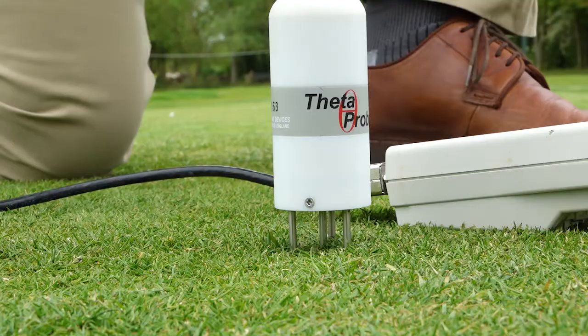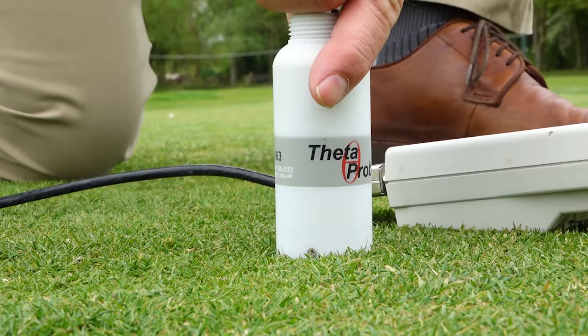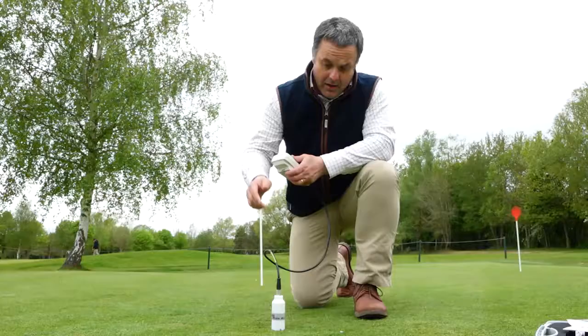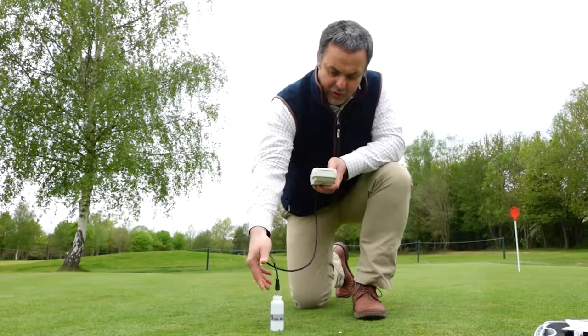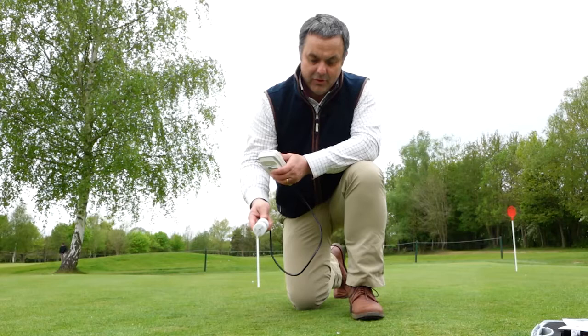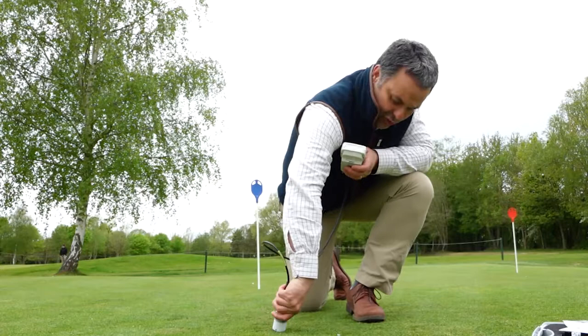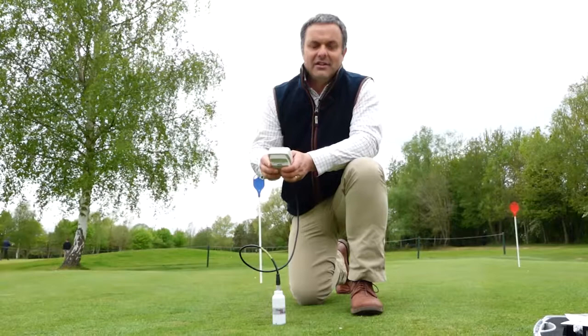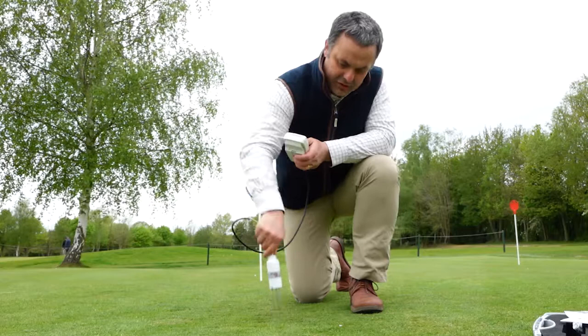So get the protocol right. Push your pins in so that the pins are fully inserted and the sensor is just resting on the soil surface. Don't force it in any more than you need to, but don't leave the pins exposed to air. Another important consideration is when you've taken your reading — by pressing read — and you withdraw the probe, pull it straight out at the same angle you pushed it in at. If you don't and you go to walk off, you're going to twist the probe as you pull it out and that could damage your pins.